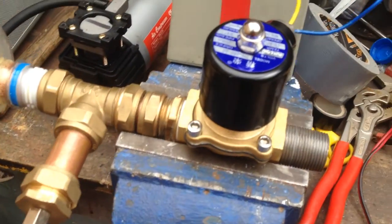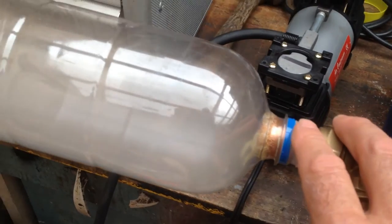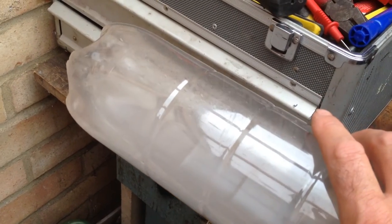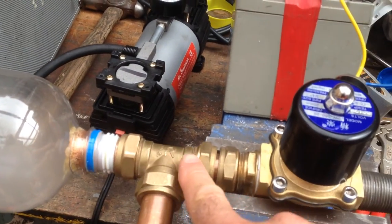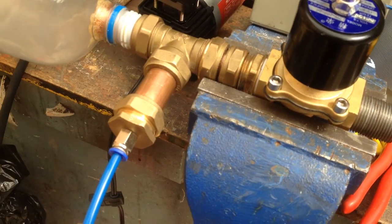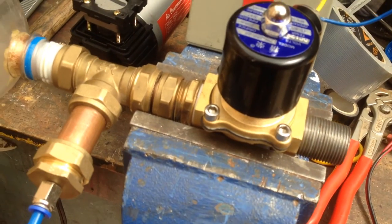The rig itself is the three-quarter inch valve, and then I have the compressor going through, charging the system up through this blue pipe. Essentially what you have is the bottle here, the air receiver here, and then there's just a 22 millimeter tube going straight to the valve and straight discharging out. It charges from 75 psi to nothing in a fraction of a second, which just goes to show that the flow rate through this valve is really quite something.